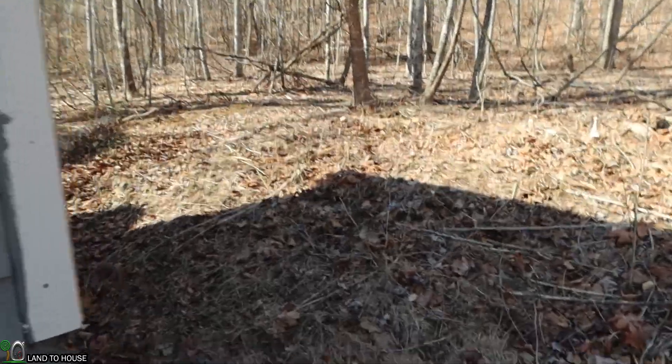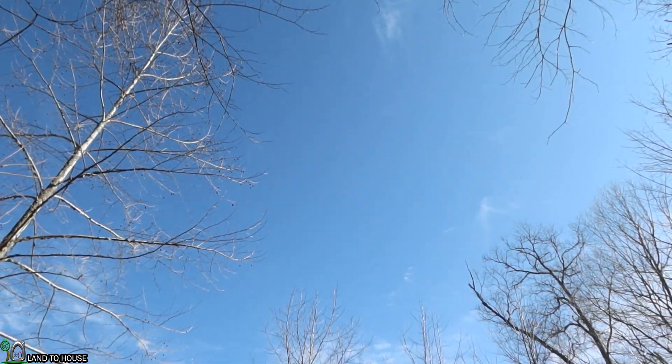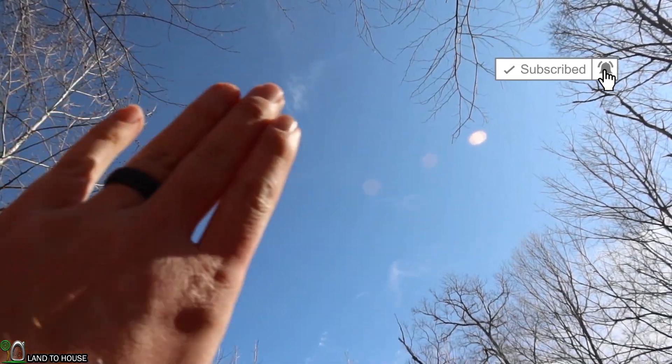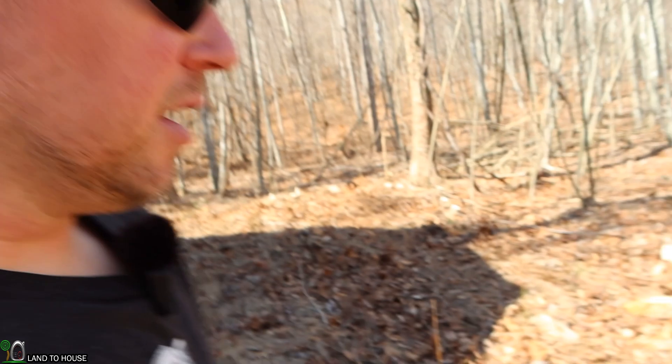I believe that's good enough for one day. I was looking at where my sun is, and I think I'm going to have to go pretty close to the shadow of the tiny house. You can see this tree right here will leaf out, and then we've got this over here, so my midday sun in the summertime is going to be right up in there for just a short time. I think what I'm going to do is not make this solar panel mount locked down so that I can move it around and find the best place. Here in the wintertime, it's kind of hard to judge when the trees aren't leafed out. So I'll just put it up here for now, and then whenever the summertime leaves are in, we can find that spot that gets the most sun.